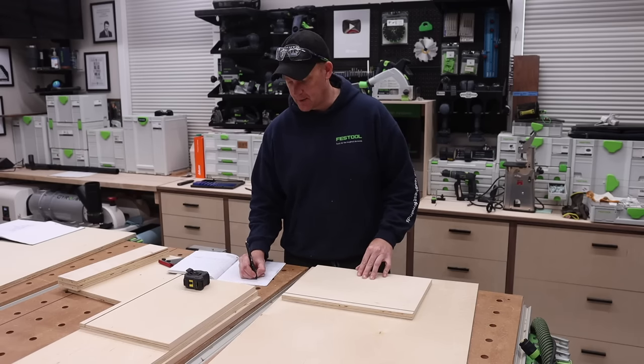There are various adjustments you can make for these hinges. First, moving the panel left or right — I simply adjust this screw and I need to go to the right just a little bit. You can also push the door in and out using another screw. And the screw at the bottom on the plate actually loosens the plate so you can shift it up or down. I've made the necessary adjustments for my door. It opens up nicely. The only thing left to do is put in the adjustable shelf — nice and flush in the front, nice and tight to the back.